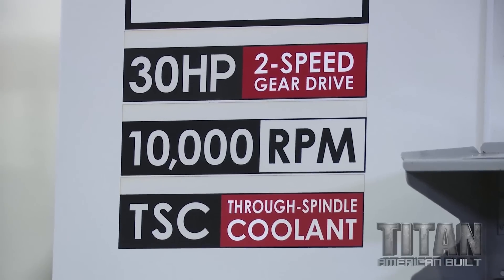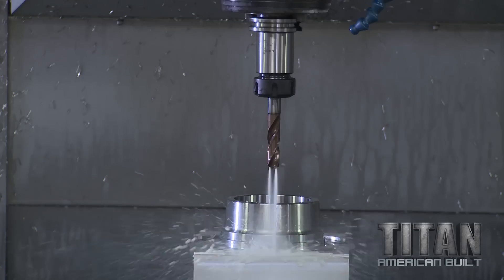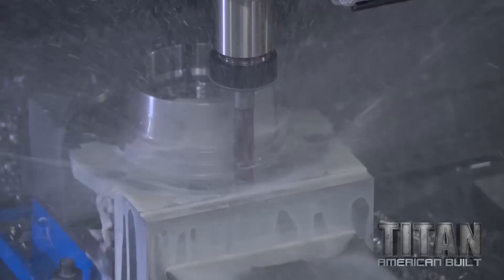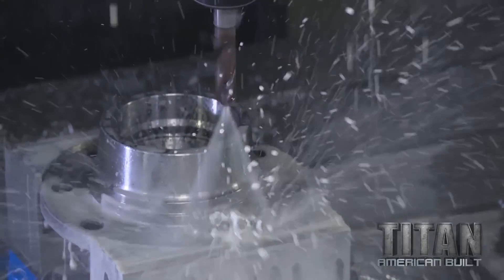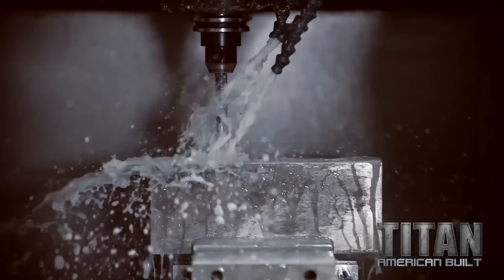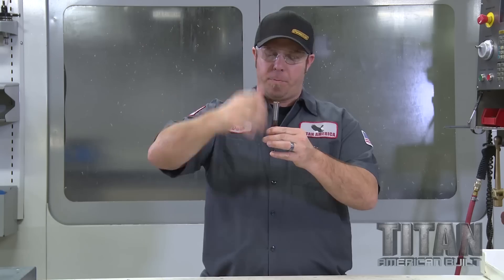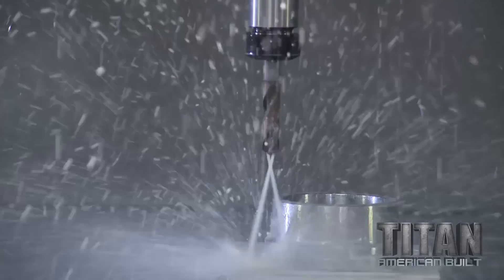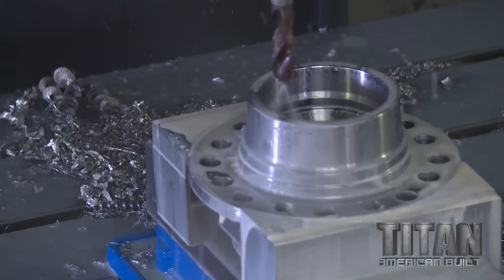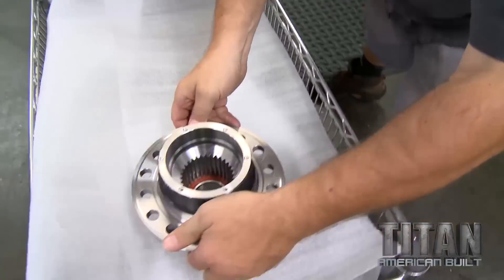We're putting Ford parts on Titan's truck — got to match his Chevy hubs to the Ford. We'll pound through the hub, which is steel, with a special through-spindle drill. The drill will drop down, hit the material — half-inch thick steel — and pound through it at 30 inches a minute. Coolant usually comes from the outside, but this drill is special: it has holes going through it so coolant blasts right through the drill, coming out the middle at the tip to keep it cool.